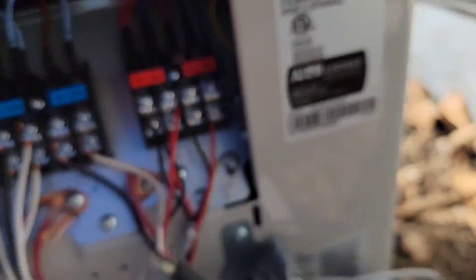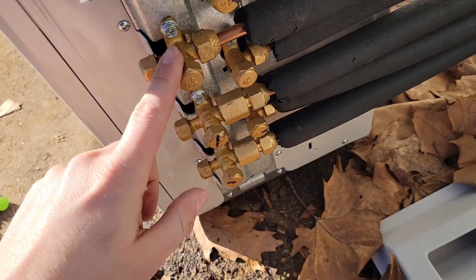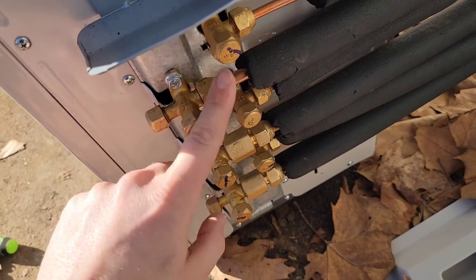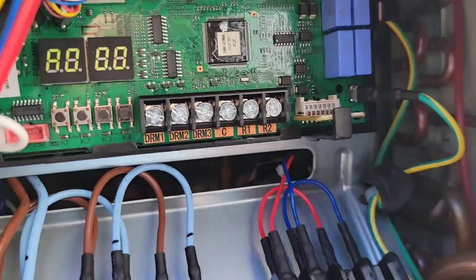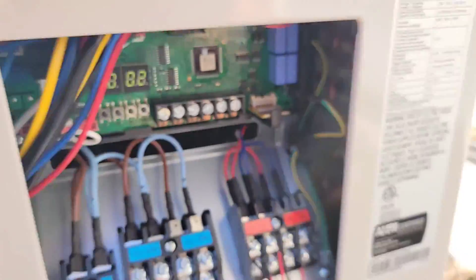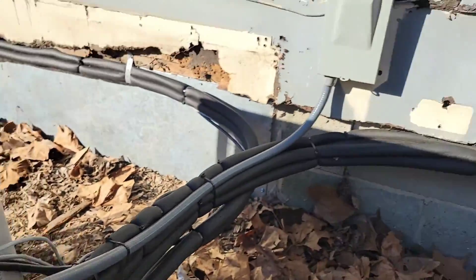With the two-ton unit — the 24 — you can do up to three indoor units. We've got three vapor connections and three liquid line connections. They did a really good job on this one. I'll also keep an extra EEPROM with me in my computer bag just in case I have a damaged EEPROM. If you don't understand anything about what I was doing with the computer and using S-Net, I've got a bunch of videos on my playlist — HVAC Tips for Technicians — to show you how to option code equipment, what the S-Net converter tool is, what the S-Net program looks like and how to use it. It's a great tool for troubleshooting Samsung mini splits.